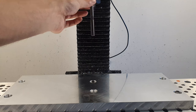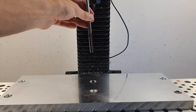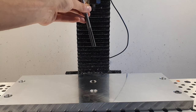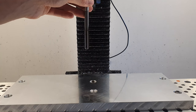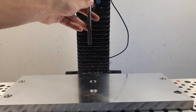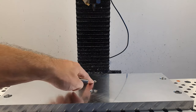But I put the reamer into a tool holder and then measured the runout at the tip, which means how concentric the tool spins. To exaggerate what it was doing, it was very minuscule, very slightly turning like this, which means your hole is gonna be bigger than if it was completely concentric with the spindle and just rotating spot on. So I measured the runout and this was not good enough, so then I decided to use a short 10mm end mill to just plunge down. And this seems to work.